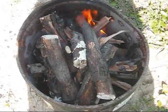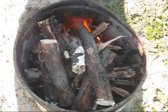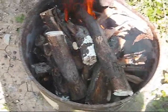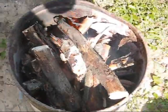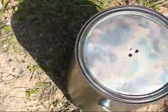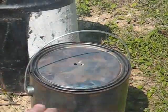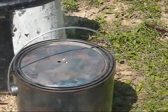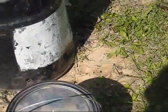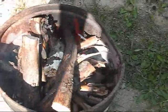Here you can see I'm getting my fire going in this steel 5-gallon bucket. And once I get this fire going all the way around the bucket, I'm going to throw my crucible — my paint can — right inside on top of the burning logs. It'll help to have this handle pulled out so that when it's done cooking, you can just stick a piece of wood in there and lift it right out of the fire without burning yourself. So I'll just wait for this fire to get going a little better here and then go on from there.